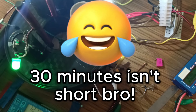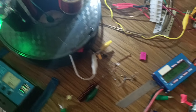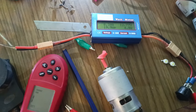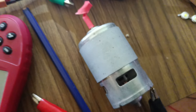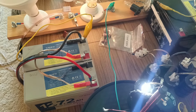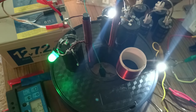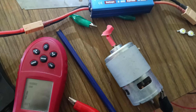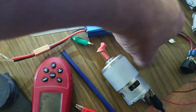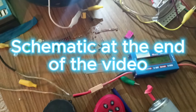I'm going to cut this video at various points so I can change the setup. My circuit can't run that motor there without a capacitor, and we'll demonstrate that now. But again, if you just wanted lighting, the circuit doesn't need a capacitor. If we want to run my motor or some other loads, then we may need a capacitor.